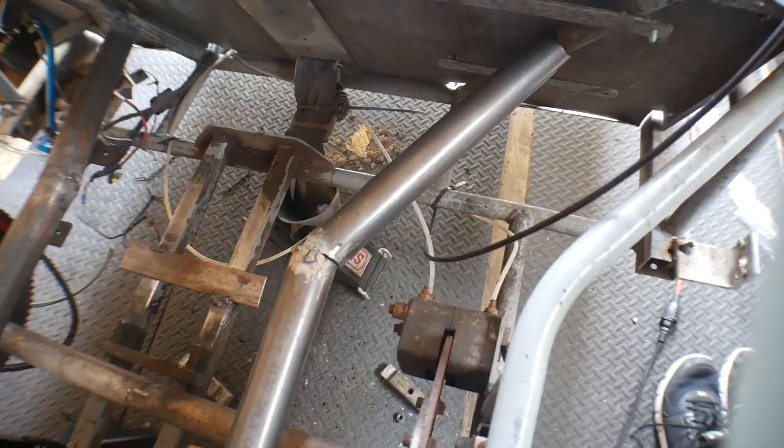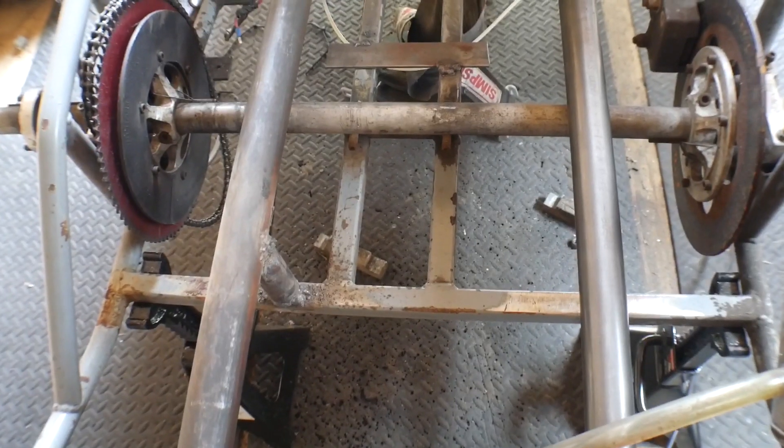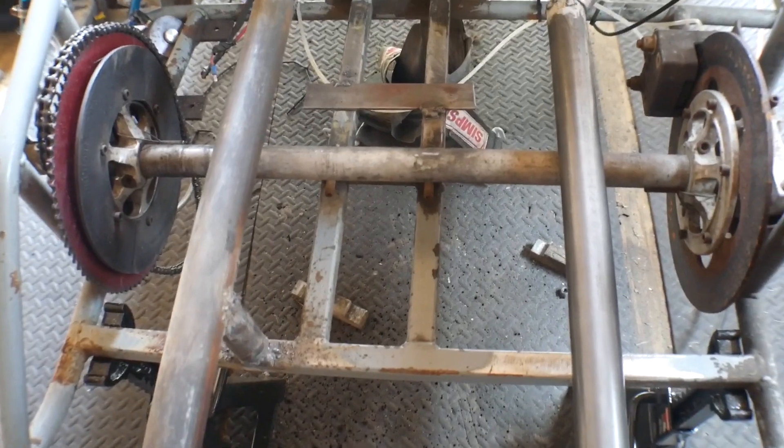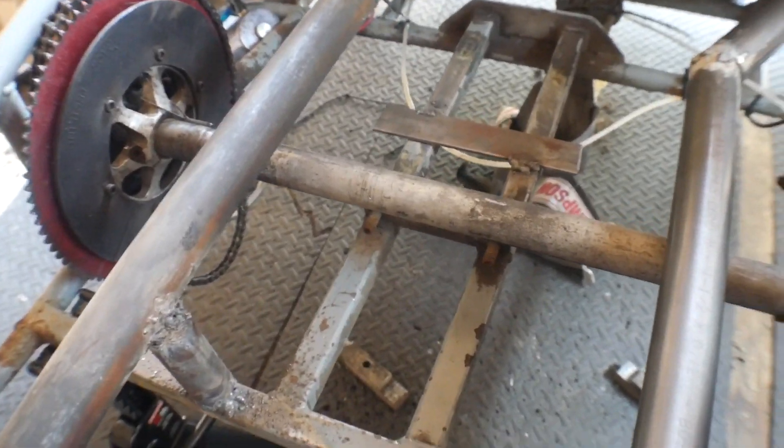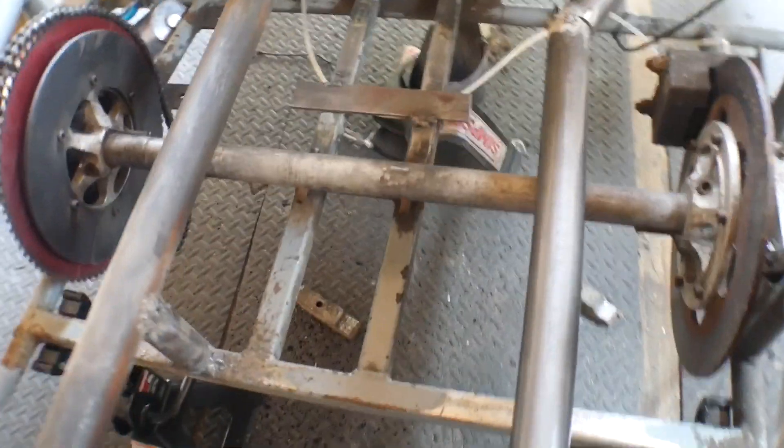We are all tacked up. I'm going to eyeball this — that looks pretty straight. It might not look very even on camera but that's just because this side is up and this side is just resting on the axle. It's the same procedure I did for this side, but they are parallel with each other. So once I do that support, they will be nice and equal on both sides. Now let's fully weld up this thing.